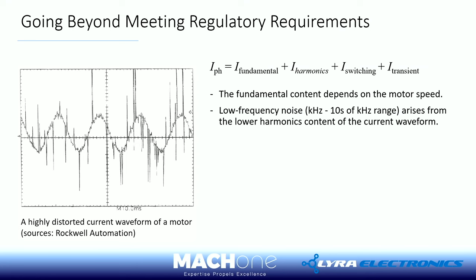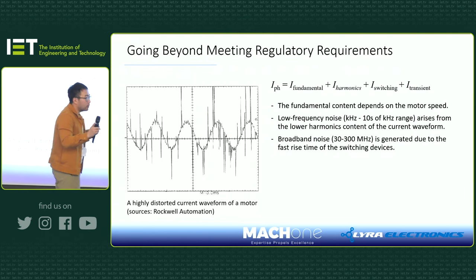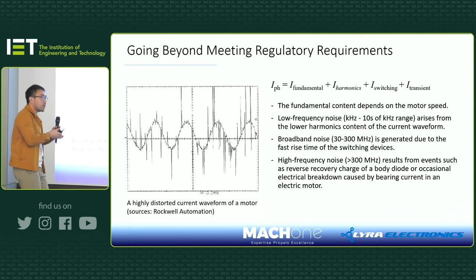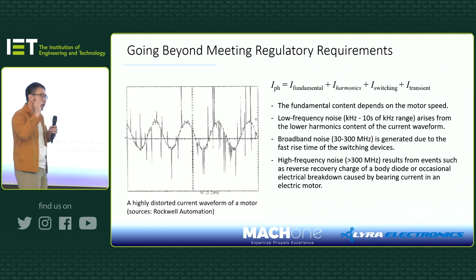And then, of course, we need to drive the motor, so we need to design an H-bridge for a single-phase or three-phase motor drive circuit, and then inevitably you introduce switching noise. These can be observed immediately, as you can see there, with little spikes. But what people don't know or often overlook is these big spikes. You can see in the graph, sometimes you've got huge spikes, and it's quite what we call narrow band. If you do the FFT, you will find it's at very high frequency.